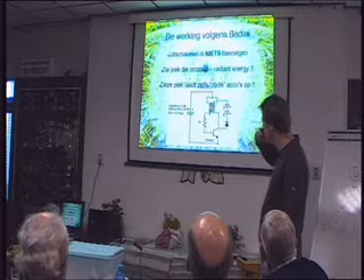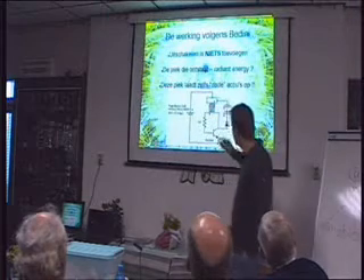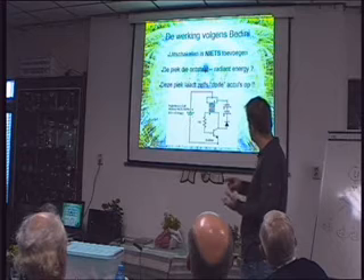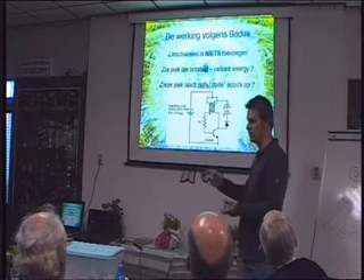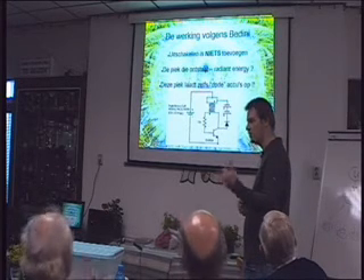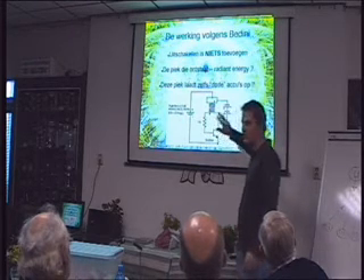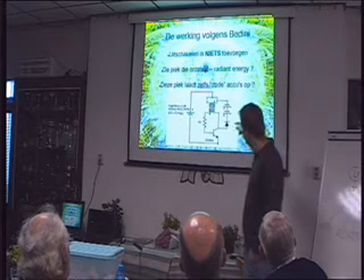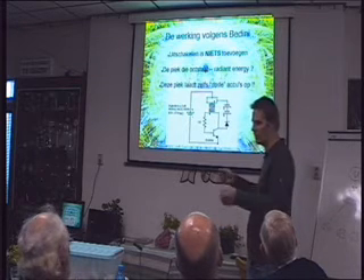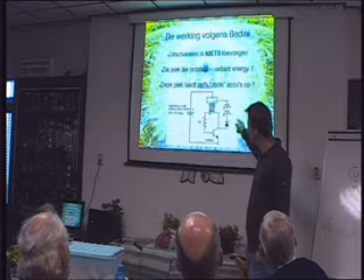This is the next thing that I did. I took one battery — it was a full rechargeable battery and I put it in here. Then I found a whole box of dead batteries — non-rechargeable batteries, rechargeable batteries — and they were all completely dead. I couldn't charge them even with normal chargers. I saw it on the internet: people started recharging batteries. So I put a diode in front of it to get just one-way current, and I put some dead batteries in series. I did this with the neodymium magnets — it all locked together — and I put them in series. And what I found is I was able to charge batteries with one battery.